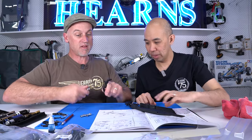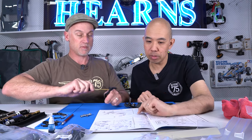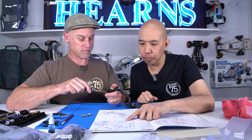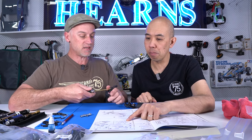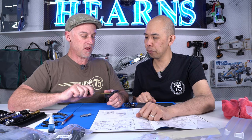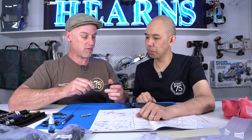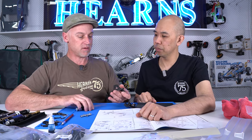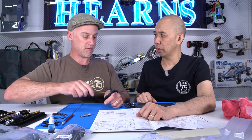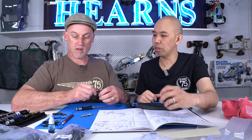That's right. What else have we got? Talk to me while I'm doing these screws up. So what I'm doing here is nipping it up to that point. And then I'm undoing it half a turn and then going again, just to ensure that it is all the way home. Because if you just keep doing it up, you can stretch all the threads. And you've got to be careful with countersunk screws, because they've got that angle. If you over tighten them, it stresses the plastic on the top.